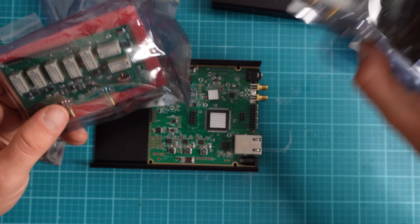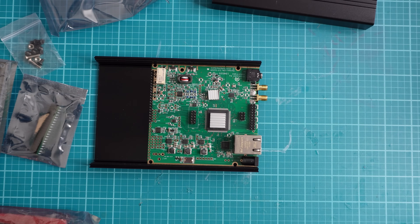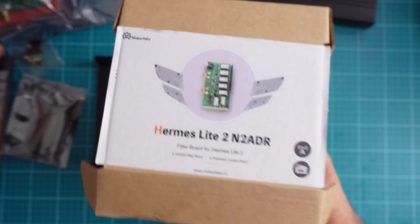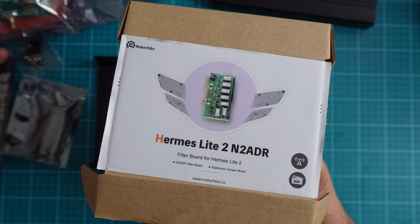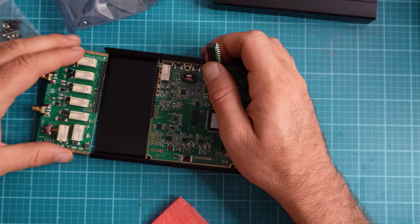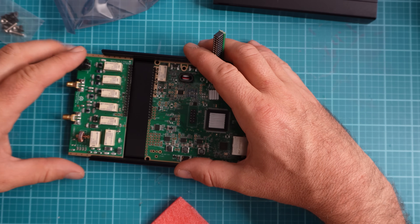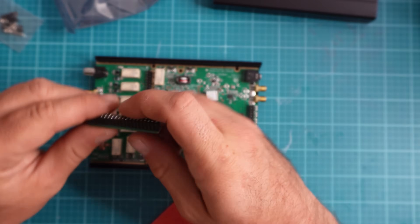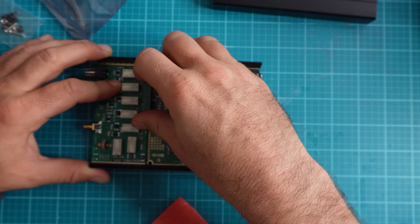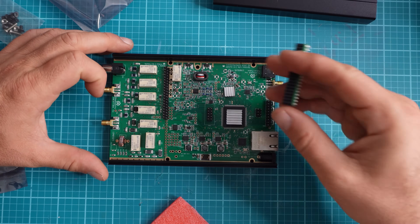Here I'm just going through trying to figure out what I need to do. If we look at the back or left side of this board on the table, we'll see some GPIO pins — input-output pins — and eventually I'm going to attach the N2ADR board to those GPIO pins. Now as I slide this into the black case, I want you to watch very closely at the pins — they're not actually quite aligned. You can cause a lot of damage right here if you try to force in this jumper. If it's misaligned and you push it, it's going to bend those pins and then you have a larger problem.